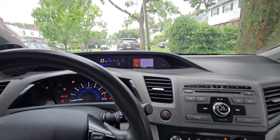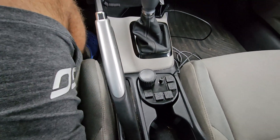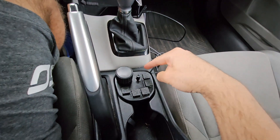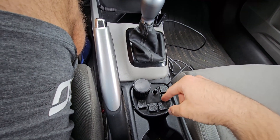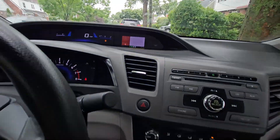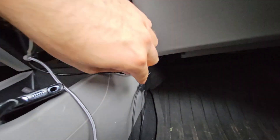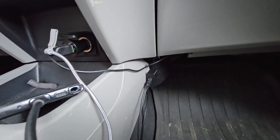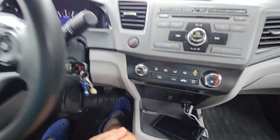We'll see Android Auto should start. Now that Android Auto has started, let's go over how it's controlled. Down here we can see the controller. This was inspired by Mazda and BMW's Android Auto controllers. It has a knob for selecting options, a directional pad for selecting screens and other menus, and each of these buttons perform a function. This entire thing acts as a kind of USB keyboard and mouse and plugs into the Android Auto system, which is underneath this plastic piece here next to the airbag computer. You can see this is where the controller plugs in — there's a little USB port I put here so I can plug in other peripherals such as keyboard and mice if I need to edit the configuration. The USB from the phone just follows the same path and goes behind the plastic cladding.